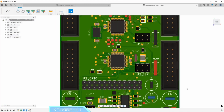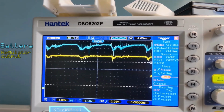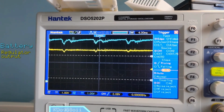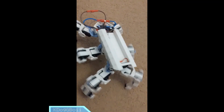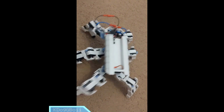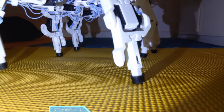It used to be the case that when Unit 0 first turned on, all of the legs would move immediately. This sudden, synchronous movement would try to gulp so much current from the batteries that the supply voltage would drop below the minimum required to run the regulator. This would cause the microcontroller to shut down. A few hundred milliseconds later, the supply rail would recover, the regulators would power back up, and the microcontroller shortly afterwards. And just like clockwork, the legs would all move at once, causing this embarrassing sequence of events to happen again and again.